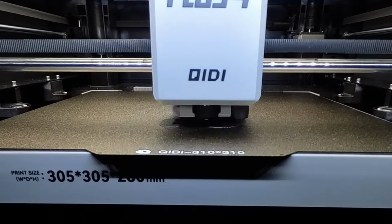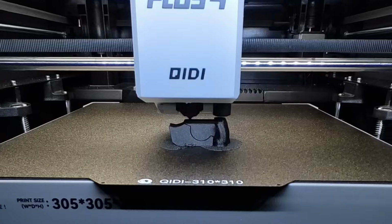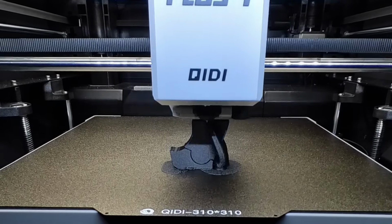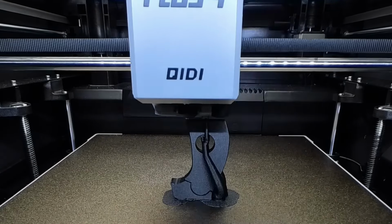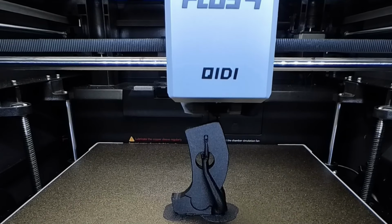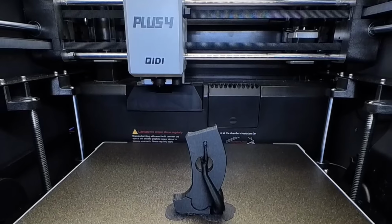So I came up with an idea to 3D print a mount or a stock to mount each side of the grip to hold them in place and perfectly aligned, so that when I sanded them, I would not round the edges off. And when you put the grips together, it's almost what you would call, I guess, a glue line seam, and they married up very nicely.